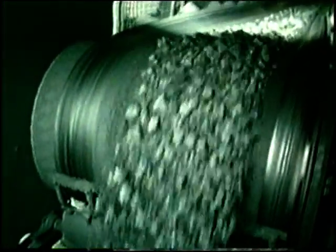These two conveyors have worked non-stop for over 6 years, delivering coke to the blast furnaces at a British Steel works. During that time, there have only been 6 sets of replacement blades. Coke fines, being very abrasive, dictated the fitting of ceramic tip blades to the scraper arms. Tungsten steel blades would only have had a life of 6 weeks under these conditions.